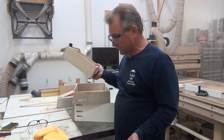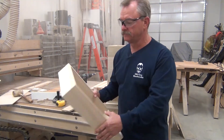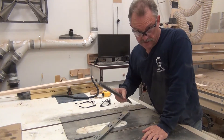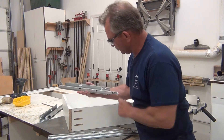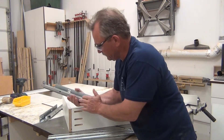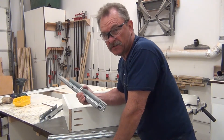A drawer is just a fancy box. There are only a few variations: the joinery on all the corners, the actual dimensions, the sides, the front and the back, and the reveal on the bottom — and that's all based on whatever hardware you're going to use. I only use two different types of drawer hardware: usually a full extension slide, which is easy to use and easy to come by, and sometimes this Blum hardware — it's called Blum Motion, soft-close self-closing, really nice stuff. I don't always use it because it's a little more pricey and your drawer dimensions have to be accurate in both width and depth, but for higher-end kitchens it's the stuff to use.